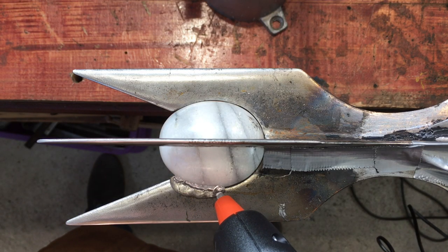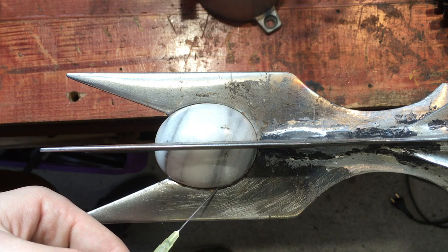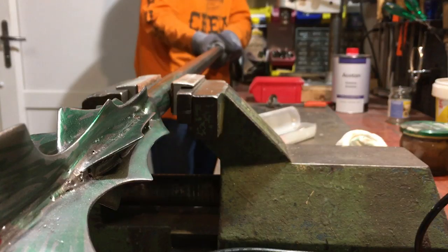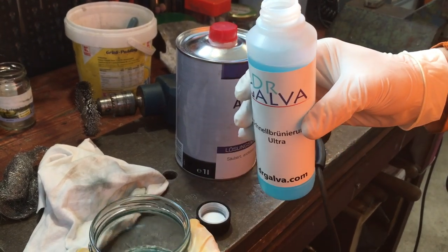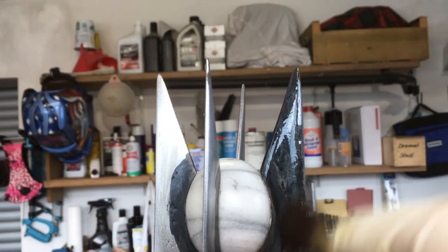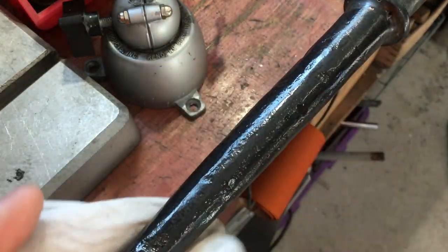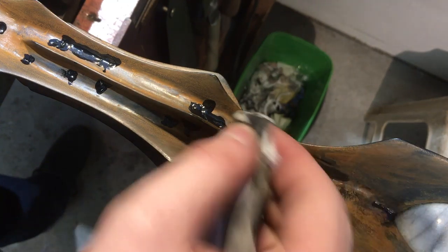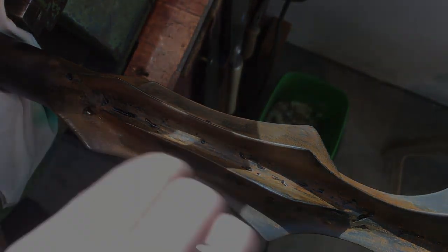Next I prepared the upper end of the rod to accept the crown. The welding was slightly better than before but there was still a lot of cleanup. To attach the marble egg to the crown, I first sealed one side with hot glue, then injected epoxy directly into the gap using a syringe. From then on I had to be extra careful not to damage the marble. After one last pass with scotch-brite I moved on to cold bluing the piece — another first for me. Here you can see the oiled blued steel and just how nice and black it looks. I also filled some holes using black nail polish, and some rust from leaving the cold blue on too long was handled with steel wool.